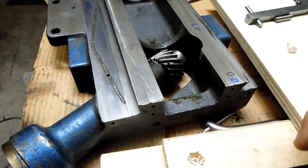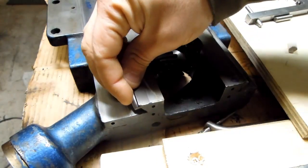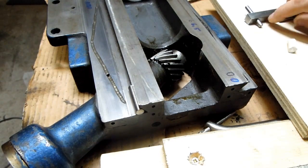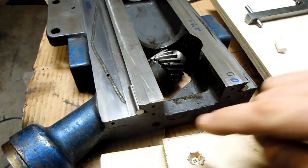And that, trying to figure out exactly where you need to cut and how much, compared to the actual mechanics of scraping, though that's certainly an art form in itself. So we're still measuring over pins here. And so it's the same set of ground pins, 8mm, and we're about that halfway point up the dovetail.